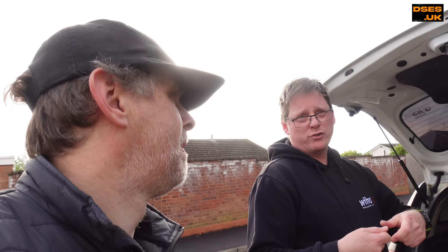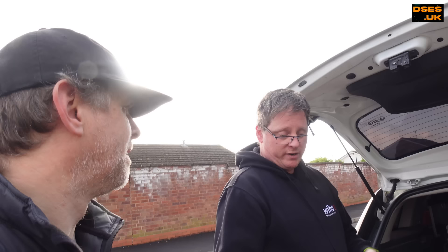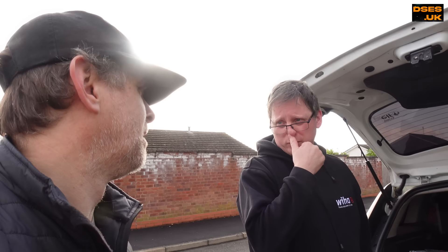I did a little reel showing the difference - like you're using the quick wire connectors with normal T&E, click click, whereas with the earth sleeving you've got to cut it. You can do the line in neutral but then I tried doing it with the tool and it's a pain in the bum. I reckon what you do is click click, then pull them off and just whip the CPC off with a pair of croppers. If I wanted a boring story I'd have kept Nige around. Right, let's load up and fork off to the job.